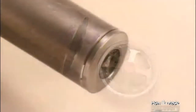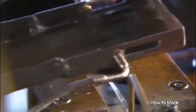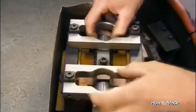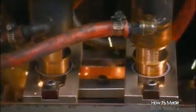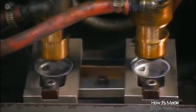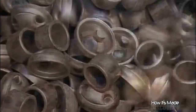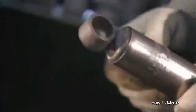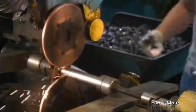The valve, now fully assembled, seals the bottom of the pressure tube. Meanwhile, a press punches round steel discs into other components — loops that mount the shock absorber to the vehicle. A worker positions a cup on each one, then a robot welds them together. They insert a cup-and-mount unit on one end of the reserve tube and weld it on. This unit is called the base assembly.